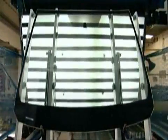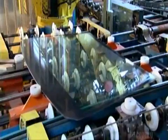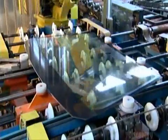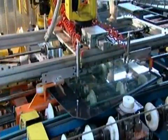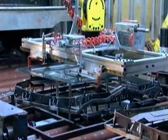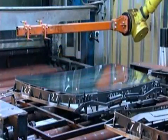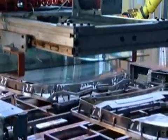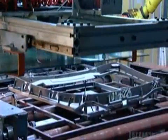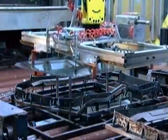Automated arms carry the glass to a station where samples are inspected visually. Rollers transfer the glass to automatic squaring pucks, which position them. Then a robot lifts the sheets of glass and carries them to four metal pins. The pins recede, and the glass falls onto a bending iron shaped like a specific windshield.